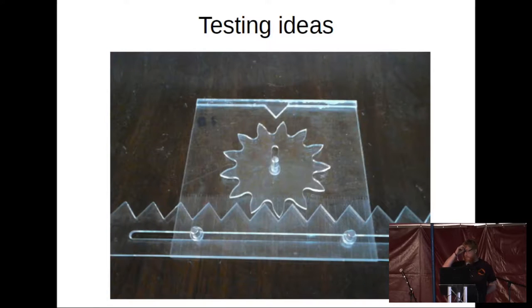Another way of testing ideas — looking at a rack and pinion idea — is to make something larger, maybe five times scale. Even with the best CAD images, there's nothing like making something and having it in your hands, poking it, prodding it, flexing it, and seeing how it works when it moves and interacts with the rest of the mechanism. These also proved invaluable because we demonstrate every couple of months to various Braillist groups around the country. It's almost empowering to give something like this to a braille audience and say 'this is what we're talking about — you can feel the gear and the pinion interact. This is how we make the dots rise up and down.' Without that, it's very difficult to explain to a visually impaired person what exactly you're talking about.